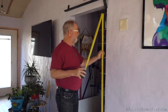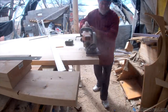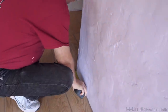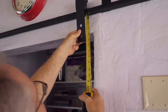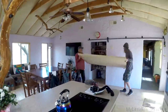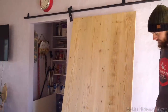Right now I want to measure for the door, so let's get our rough openings. We need to be 78 on one side — this is 78 and a half on the other, so it's a bit of a slope — and then 39 and a half, 39 and three-eighths. I want to be able to go outside of that dimension, and then which gap do I want? Lots of measurements to think about. She's going to draw it on there before I do too much more work. That is absolutely beautiful — it's gorgeous. It's going to work.